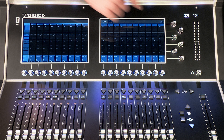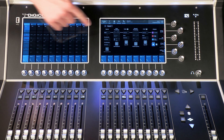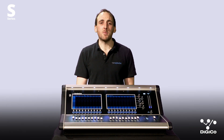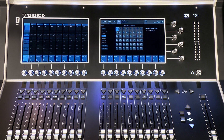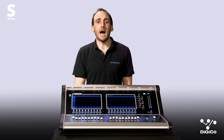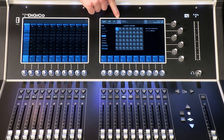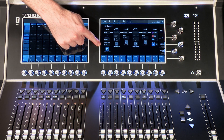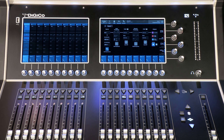Once you have patched in your signal and want to set up the UbiMadi, on the input route page select Recording Send. This will take you to the Recording Send window and will automatically have the UbiMadi selected. Tapping on USB-OUT1 will now send the input signal on channel 1 to your connected DAW. At the top of the screen you will see a box labelled Send/Return. With this box selected the return signal will be automatically patched from USB-IN1.